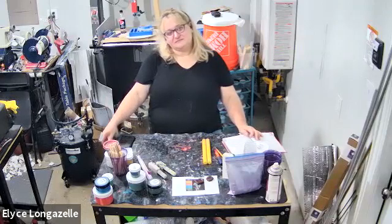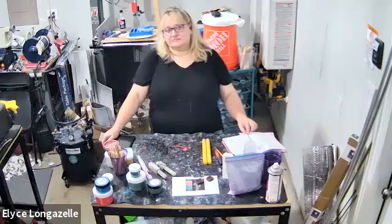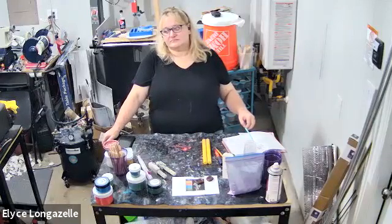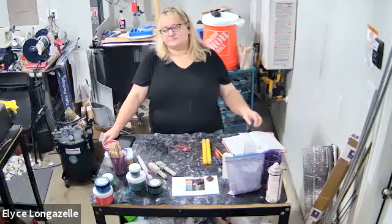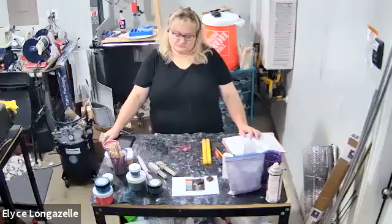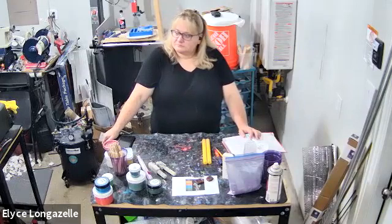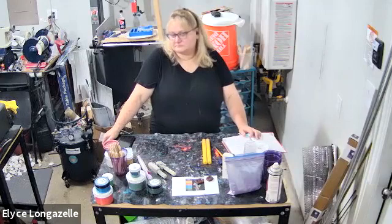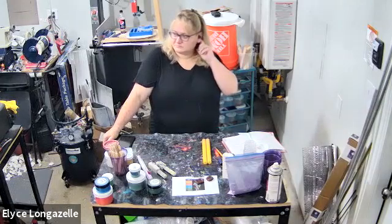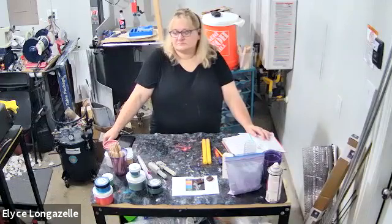Awesome. Do the rods have a shelf life, where the properties change over time to where they at some point become unusable? I thought I had heard somebody mention that they will get harder and more brittle, but I'm not sure what material they were using. With Alumilite, I've not had that problem yet. Of course, we don't have rods stay around for very long. Polyester resin over time gets very, very hard and brittle. Ebonite will also get hard and brittle, but that's not something we would necessarily pour. Epoxies will yellow over time and can potentially change color. But I haven't seen anything go south, really. If anything, the mix wasn't right, the proportion of A and B was off, and you end up getting a very soft, unusable rod that no matter how long you sit, it'll never cure. Interesting. Thanks.